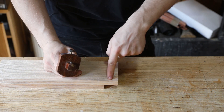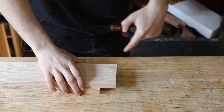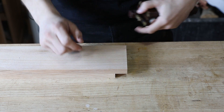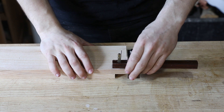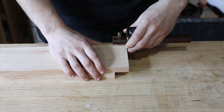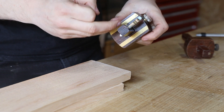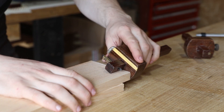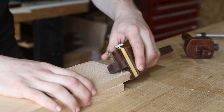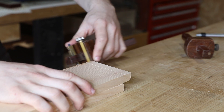Quite possibly the most common mistake I see a lot of beginners make when using a marking gauge for the first time is getting that line straight. The main reasons are using too much pressure and not using the correct angle of attack, especially with old traditional style marking gauges. A lot of people dig the pin in and try to create that line as deep as possible in one go, which ends up ragged, not straight, and an absolute nightmare to clean off afterwards. Instead, what you need to do is a series of light successive passes to create that line gradually. Make use of the rounded edges on this gauge - put it on and roll it over one of those edges until the knife engages in the wood, creating a datum surface to rest the gauge on, which makes it so much easier to use.